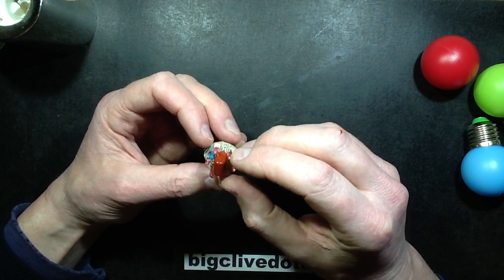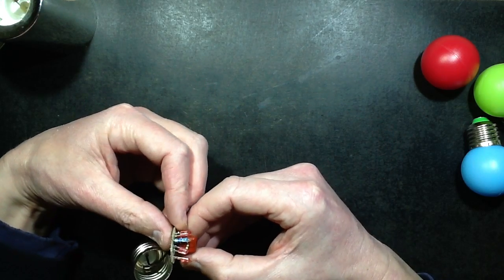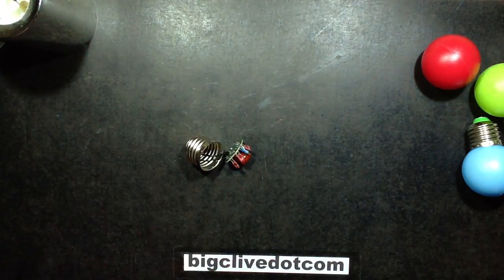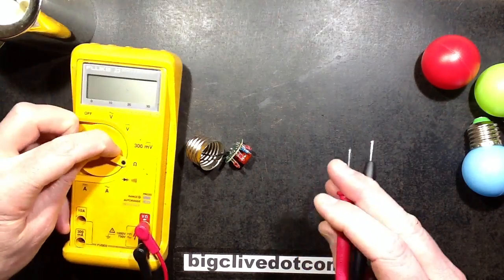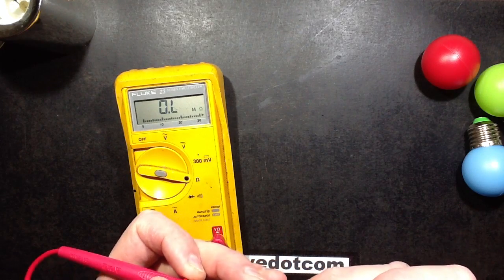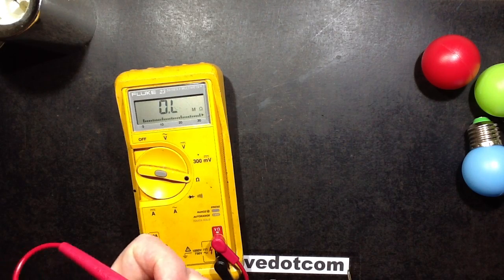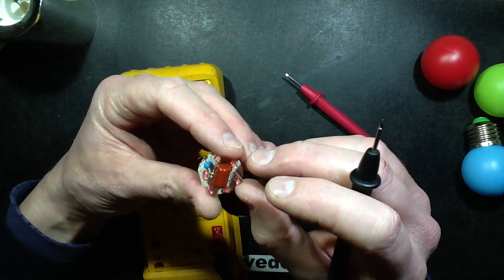Unless they're wiring the LEDs in reverse parallel, because the circuitry is very simple. It's an inrush-limiting resistor with a value of 470 ohms — good choice, good value. That'll keep the inrush current quite low, particularly given there's no smoothing with an electrolytic to take away the sharp spikes. That tiny little resistor is probably soldered across the capacitor.